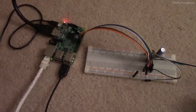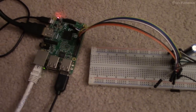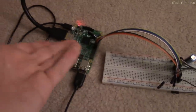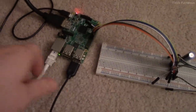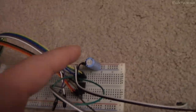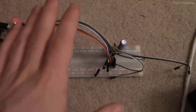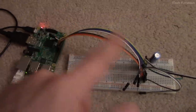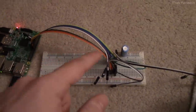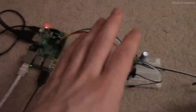This is my SPI flash flashing apparatus — just an old Raspberry Pi Model B, third generation I think. Any Raspberry Pi can do this. I'm powering it from a power bank, and I've got a keyboard and little monitor connected. The actual chip I've taken off the motherboard and put in the breadboard, with some wires going over. You can find the pin out online. Really what you're doing is connecting the SPI lines directly — so the MISO and MOSI, then you connect the chip select, the right pin, and then 3.3 volts and ground. You can power this chip off 3.3 volts from the regulator built into the Raspberry Pi — it's only capable of supplying about 50 milliamps, which is totally fine for a chip like this.